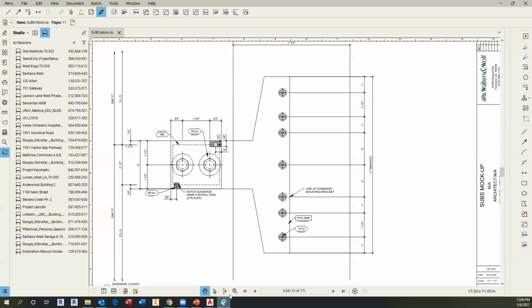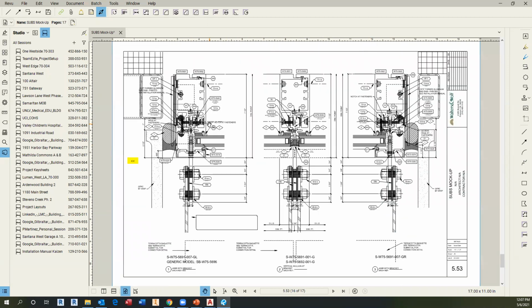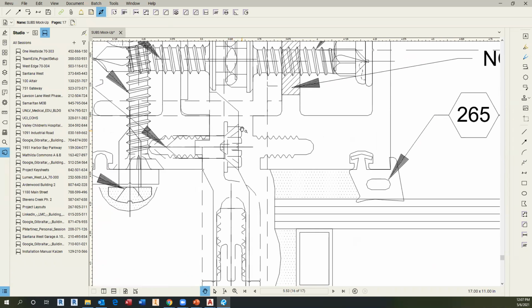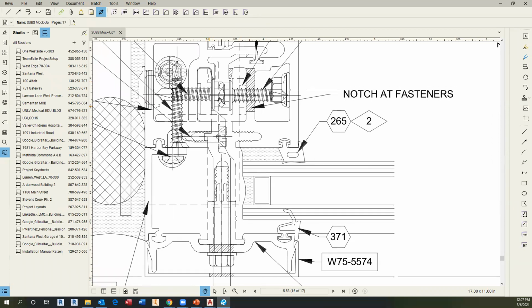When you are creating a Sunshade bracket, it's important to follow exactly what you have on the parts because the vendor is going to use it later to create the parts. So they use our model and it should be accurate. For example, you'll notice we have a countersink hole at the back of the Sunshade bracket, and it's for the attachment or position in place. So it's important to model your Sunshade bracket with that particular notch. That's going to be another tool you have to follow in the same logic.